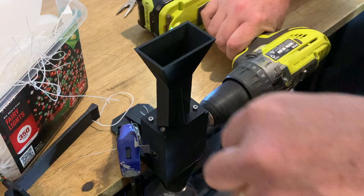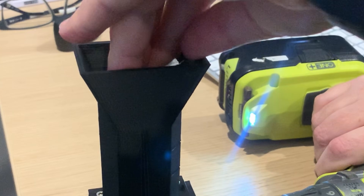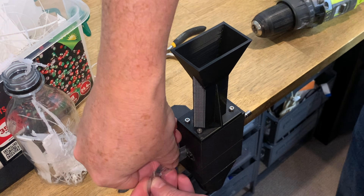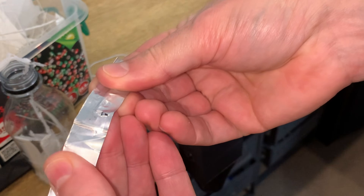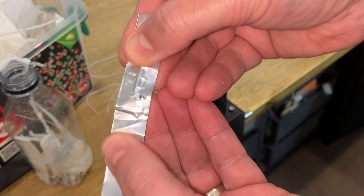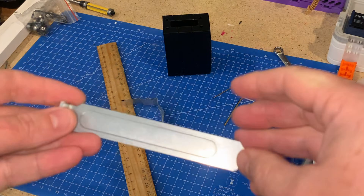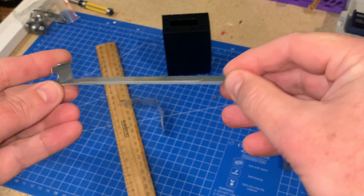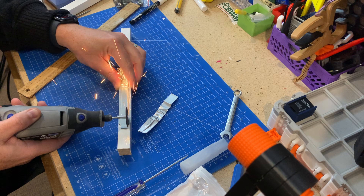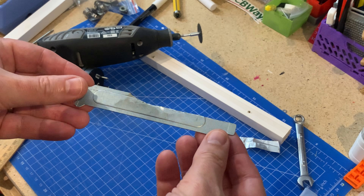A great part of this model is nothing's escaping and I can just take the bottle off, put another one on, and really easily refeed that first shred through to go smaller. I did end up having a problem with the aluminum shield I made — clearly it wasn't strong enough to hold up against the pressure of parts getting shredded against it. I took an expansion card blank off an old PC and cut it down a tiny bit, got some sparks going, and it slid in really well — so if you're doing this as cheap as possible, that might be an option for you too.